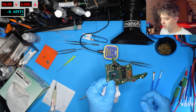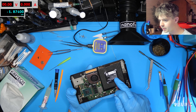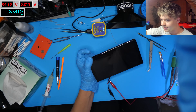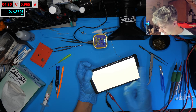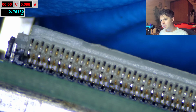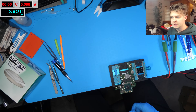The SoC is looking much cleaner now and I got the flex cable installed preemptively because I didn't want that dat zero wire flying everywhere — especially with how thin it is. I've got this on the customer's screen, but we have a dead battery so I'm using the bench power supply to boot it. Turning on the power and pressing the power button — okay, weird. The display is all yellow. I think that's going to be a display connector issue. The board is actually in Horizon OS, so the board works — it's just the display is yellow. I see the problem: that pin is probably pushed further in than it should be. It's actually pushed inwards, so this may end up being an FPC replacement.